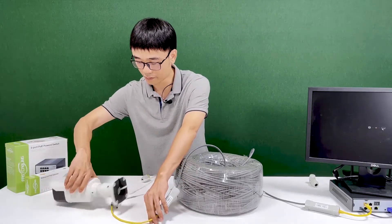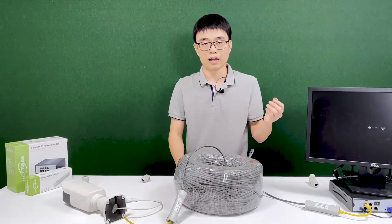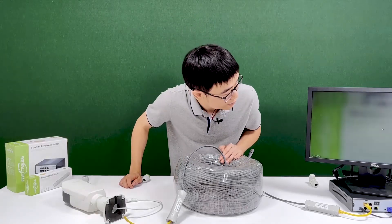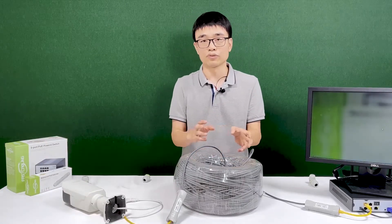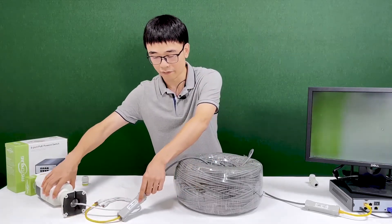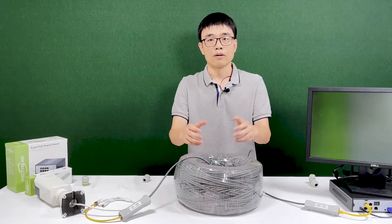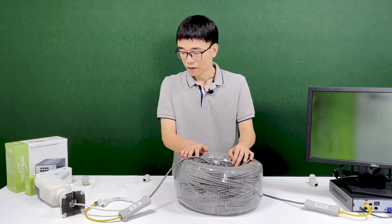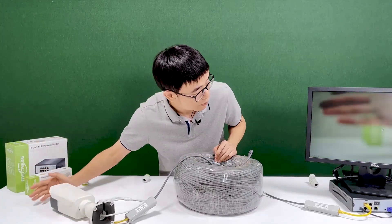Now once I plug in, I can hear the motor running — this is a motorized zoom camera. It will take a while before we can see the live video on the monitor, and it may be fuzzy at the beginning. Now I think we're getting the live feed, but it's quite fuzzy because the motor is still zooming to find the best focus. The beautiful thing is we have nothing but cable between these two PoE extenders, and the maximum distance is about 1,000 feet. You can bury this cable without any concern. Let's move a little to get the best focus.